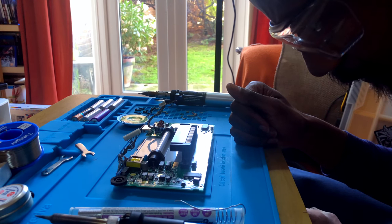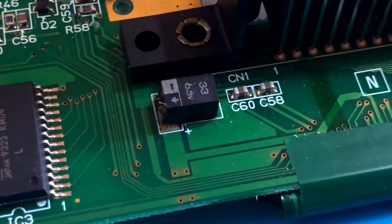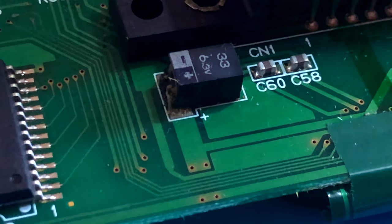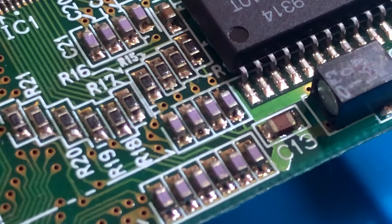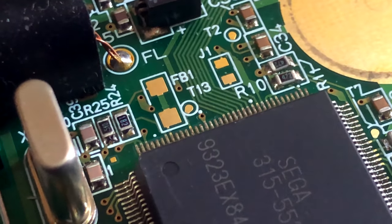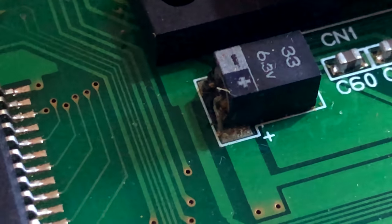I'm doing a really close inspection. That's one of the capacitors and it's really worn out on the connector — on the actual bit where it solders onto the board. It should look relatively shiny and flat and flush, kind of like that connector that says FL there, but it just looks really dusty and scratchy, and that generally isn't just from age — that usually happens if it's leaked or something.